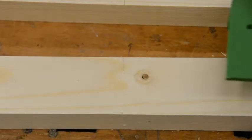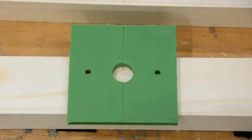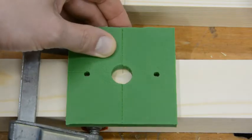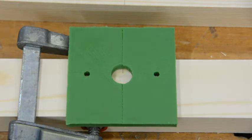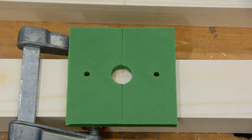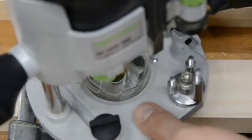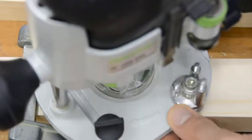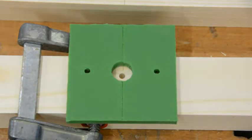After cutting all the pieces to their final length, I use a modified version of my 3D printed doweling jig to place a few holes for bookshelf pins. Realistically, we are most likely never going to reposition the shelves, so I won't put hundreds of holes in the upright pieces, but just in the places where I want the shelves to sit. If you're interested in the 3D model for this jig, I will place a link in the description.